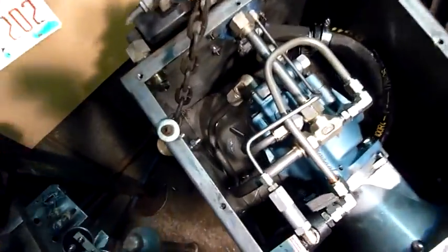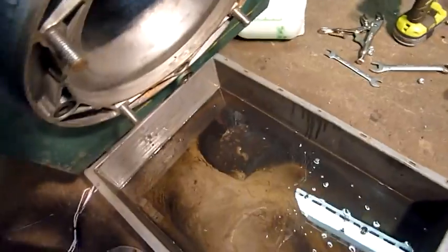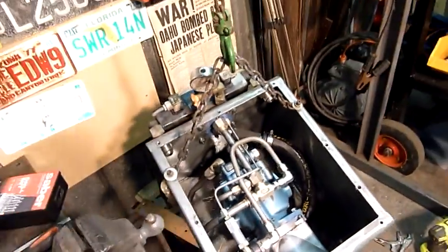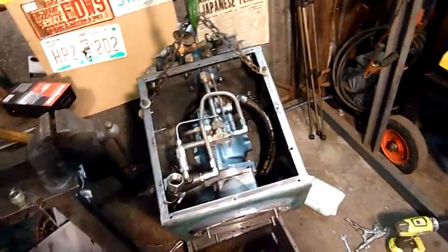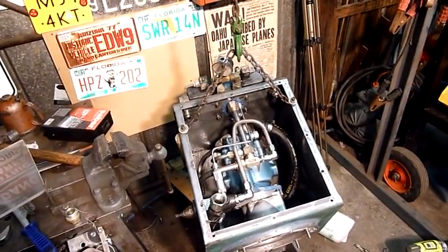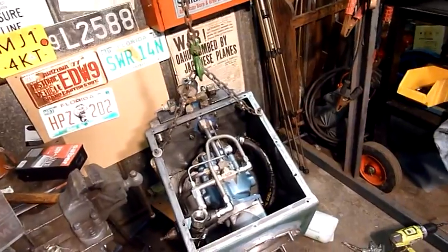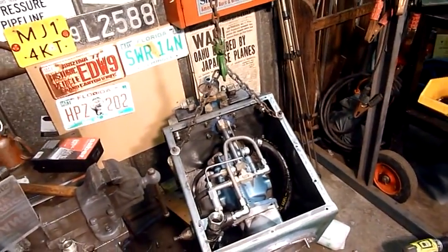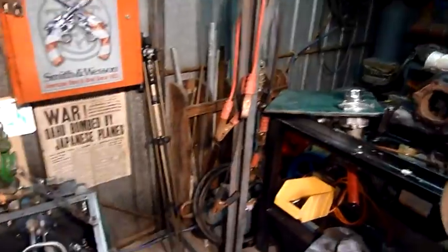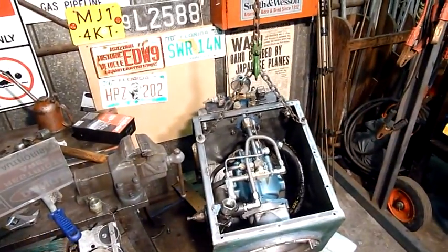So I'm just cleaning the tank out now with a scraper and tub, and it's puking up some pretty nasty stuff, but that's typical tank sediment from many years of operation. I'm going to flood it with some of the waste oil — I've got probably 40 litres of recovered oil that came out of the tank — so I'm going to use the worst of it just to wash it out, then move on to the better stuff and a drum of new stuff to actually fill it. I'll also clean the lid up and its gasket and basically just glue the top back down again.